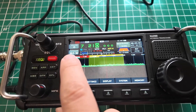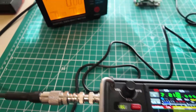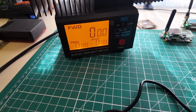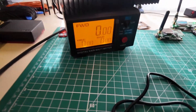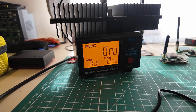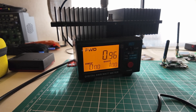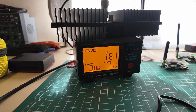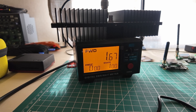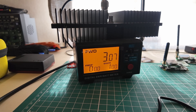This was something I was alerted to look out for. We're at 8 watts now — I'm going to turn this all the way down to half a watt. I've got it on a power meter and into a dummy load, and it's on wide FM mode. I'm going to key up and turn the power up. At half a watt we're putting out almost 1 watt. At 5 watts we're only putting out 1.75 watts. Going up to 8 watts all the way — that's 3 watts out on the meter. That's not very good. So check your power before and after and be prepared.